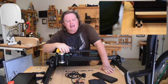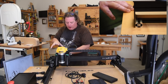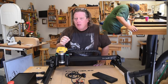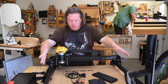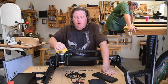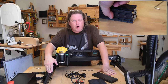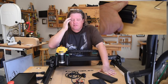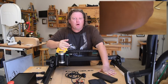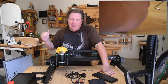And the machining problem I had is when I was assembling it, I came to a point where I was assembling this back corner right here, and I noticed there was a gap, and I couldn't figure out why. I then measured my two side rails, and I found out that one was actually longer than the other. I also noted the cut on the end of the longer one wasn't a perfectly flat surface. So I just decided to recut it myself. I cut them both to equal length and I reinstalled it, and it took care of most of the gap.